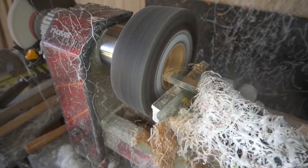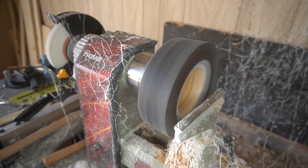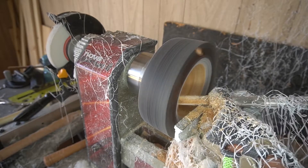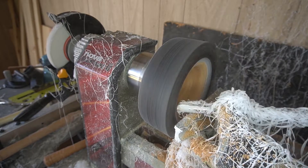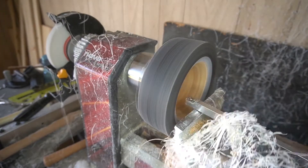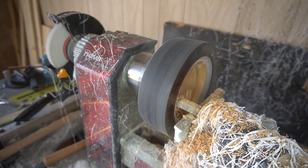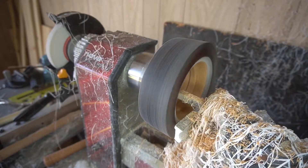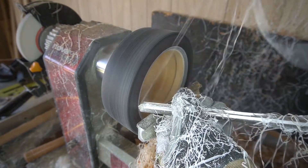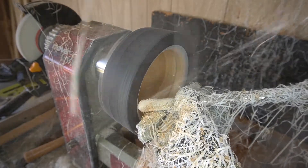Middle portion of the project, not too difficult to gouge out. Still getting pretty good shavings off of it. I did have a little bit of chatter once I started getting off toward the edges, only because I would gouge out the wooden portions of the bowl. But once it switched materials from wood to epoxy, you could really feel that in the chisel, and that was a bit of a problem. It didn't fly off the lathe, but you definitely felt that uneasiness as you're gouging closer and closer toward the edges of the wall of the bowl.